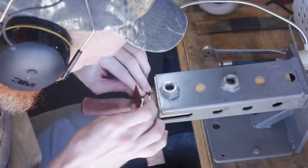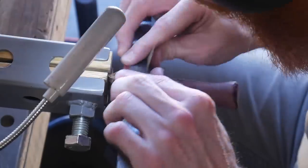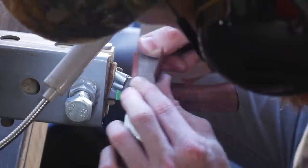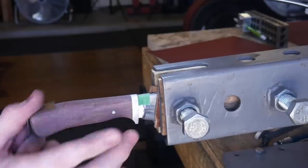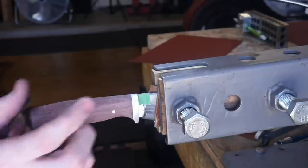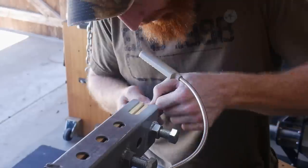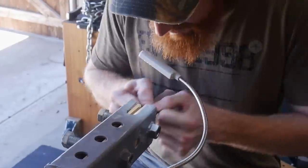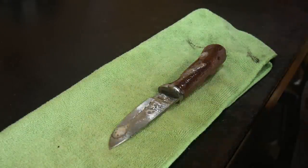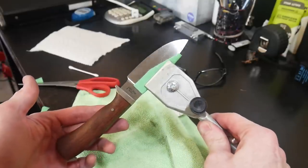This took a good deal of time because I wanted to make sure my scratches were all going in the same direction on the guard and I wanted to bring the handle up to around a 1000-grit finish. My grit progression started at 320, moved to 600, and then finally 1000-grit paper. On the 1000-grit paper, I started using my hands and fingers more than the hard backings since I wasn't really taking away much material at that point.